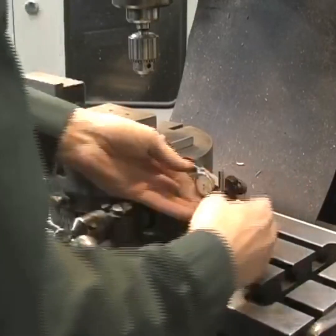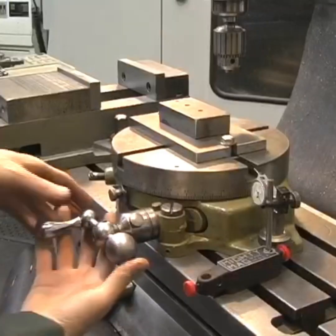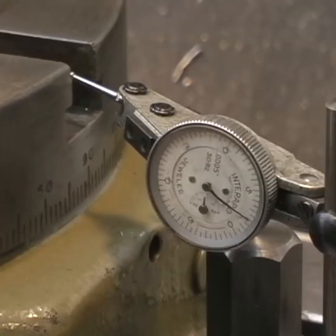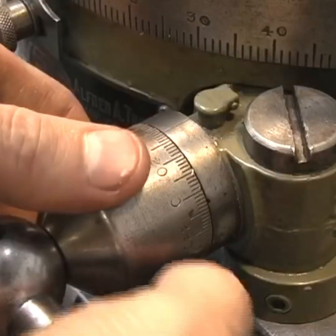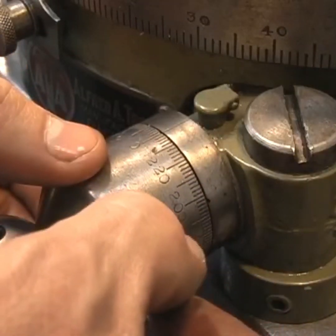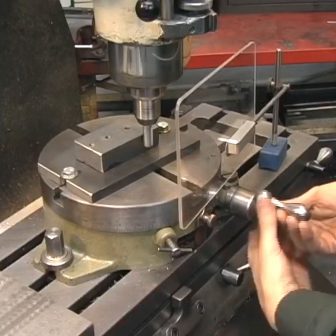When the workpiece is centered and squared, I need to remove the backlash in the rotary table. I'll use a dial indicator to mark the position of the table, then unscrew the feed screw to remove the backlash, then screw it back in clockwise until I get back to my original position. This eliminates all of the backlash in the screw, and then I can zero the dial so that all of the readings become meaningful when I turn the knob clockwise.